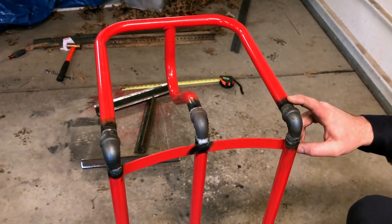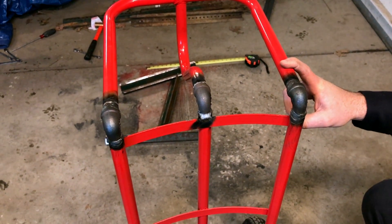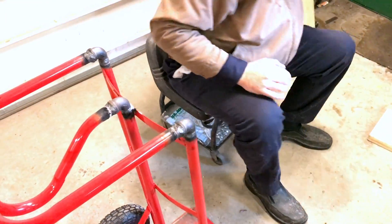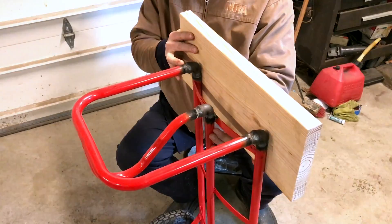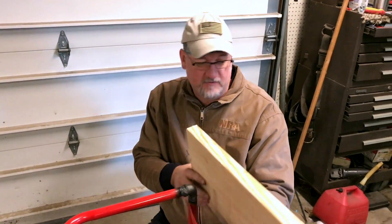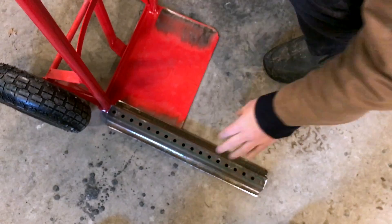I have a 9.8 Mercury outboard and I was not happy with the outboard stands that we had. So I decided to take a 600-pound dolly — it's a relatively cheap dolly, about $40. I cut the handle off with a pipe cutter and basically welded some street L's in it with pipe to turn the handle. Then I'm going to get a piece of wood, mount it here, drill holes into it so it will hold the engine, and build the base out of some old angle iron I had laying around.